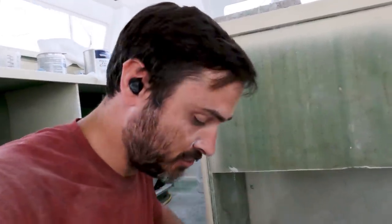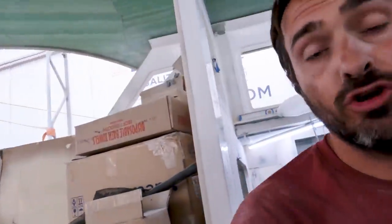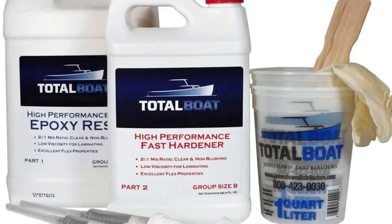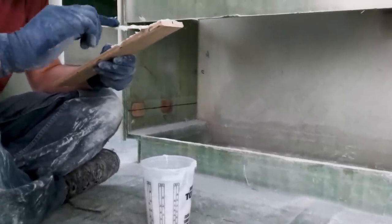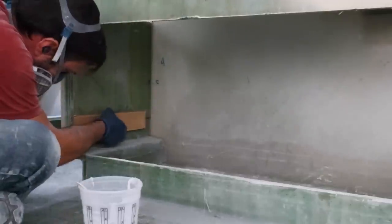I've milled it down — it's now about 11 millimeters on one side and about 21 millimeters on the other. I have those two going in, and right here you can see my effort to figure out exactly where that's going to go — two different pieces for those drawers will get put in place as well. Because I'm using plywood I'm using epoxy — Total Boat epoxy mixed with colloidal silica and cotton flock to a nice consistency. I'll apply that to back these boards, stick them into place, and let them cure before starting to put in the actual drawer tracks.